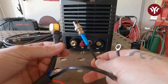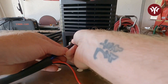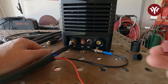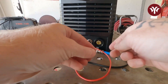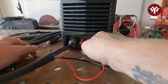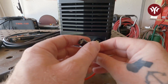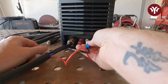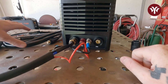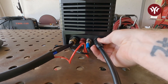The direction this is facing is really important and this arrow tells you which way. On the torch itself, we have three attachments to plug in. We have the air line, the arc start, and the trigger control — keeping in mind that this is a two pin and we want to line those up correctly, and it also has a notch right here that we also want to align correctly. And then lastly, we put our ground right there and now we are ready to fire it up and start cutting.